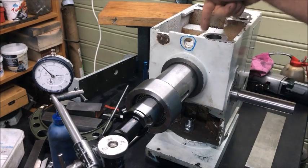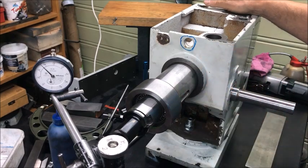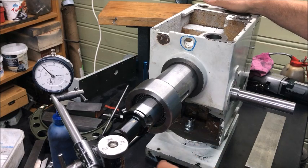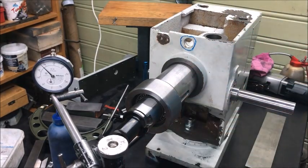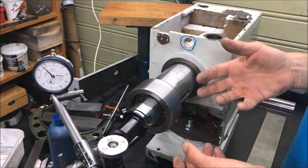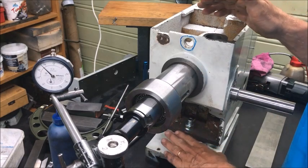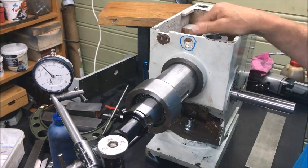So I will try to measure now on the full length here, on the inside of the actual casting, to see where I should put this alignment to the table. The spindle and the column ideally should be totally in line. But if the locking mechanism throws this off by some hundredths, I don't know if we should keep it that way — but I think so. My idea is — I'm really thinking as I go now — at this point I think we'll have to take the column-to-spindle alignment as good as possible to the bore. That should be it.